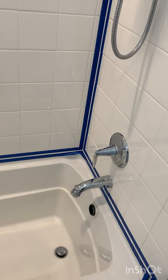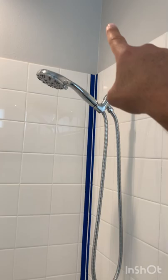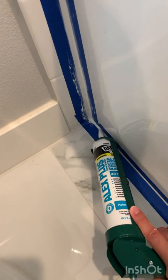You've seen people wipe it down with their finger to fill the crack with the bead. A little secret tip I saw on another YouTube video: use a tiny bit of water and soap mixture so that your finger is slippery and the caulk doesn't stick all over your hand — it comes off much easier at the end. Here's an attempt at a single-handed bead for the camera: get in the corner, gently squeeze, and move with a steady motion.